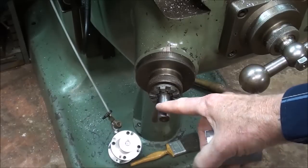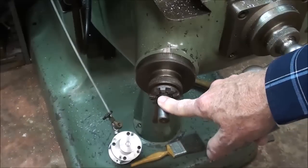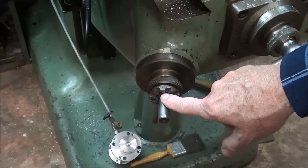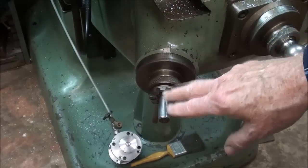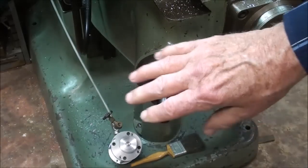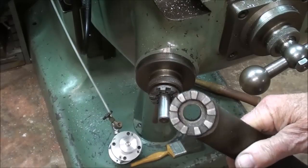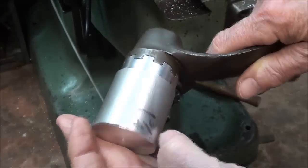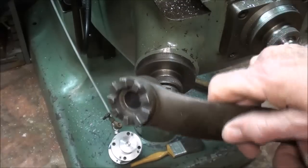This is a 5/8" diameter shaft here — measure the length on yours. I think all genuine Bridgeports and clones are probably about the same, but I don't know that for sure. To aggravate things, the cogs on here are number 9 — not an even number but an odd number, and that makes it just a little bit more difficult. Take all your dimensions off of this and double-check them against the dimensions I give you.